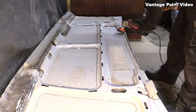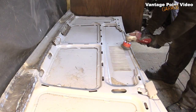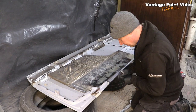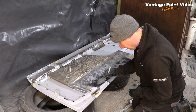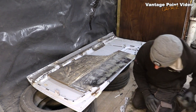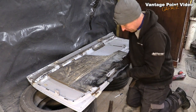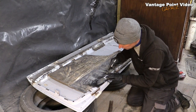Cleaned in underneath it with the wire wheel. I'd give that a little bit of primer before fitting in the piece. Marked it now. I had the hole, so I'd have the exact right length. I hammered the piece that I cut out flat to get the length of metal I'd need. And theoretically, I should have enough then after I folded it.